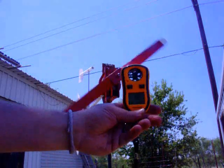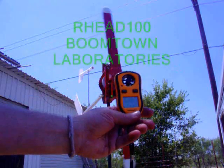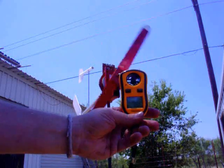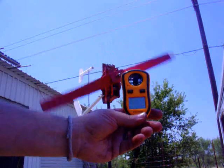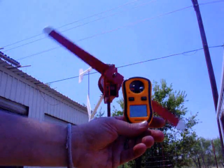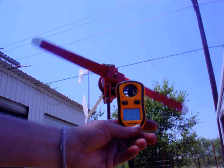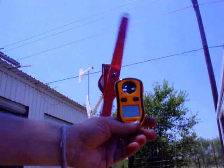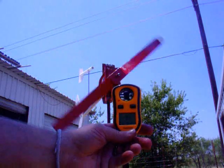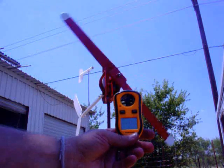By the way, this handy little anemometer is a complement of Boomtown Laboratories, Raymond Head, our Head 100 YouTube channel. She's doing pretty nice, starting up on her own. I had a little problem with the bearings — the shaft was a little short where the seat of the bearing was, so when everything got tightened up it was pushing the races together a little bit too much. I made a small adaptation — took one washer and about 5 minutes worth of grinding — then one more adaptation. I think she's ready to go up on the roof.